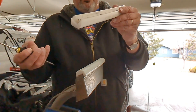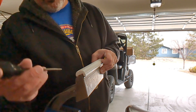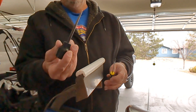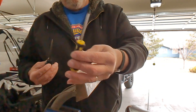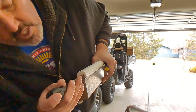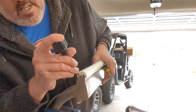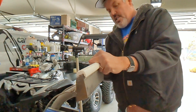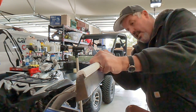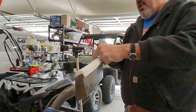I'm working on a little substitute for the time being. The best way to get these glides off is to take a carpet awl, grandma's ice pick, or small Phillips screwdriver, and put it into one of the two slots created by the plug. Just get it in there half an inch and you can see it just pries up.